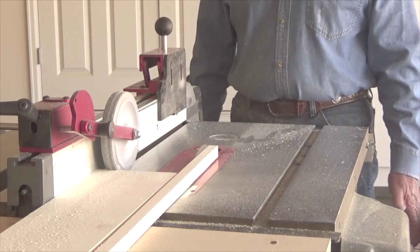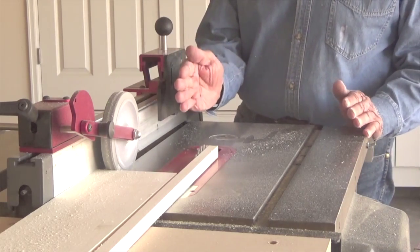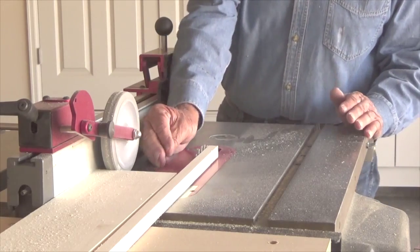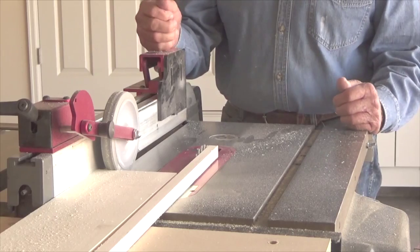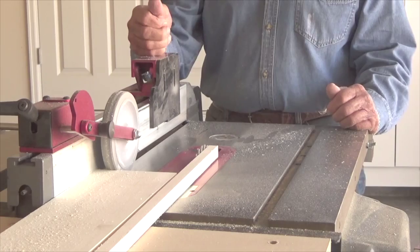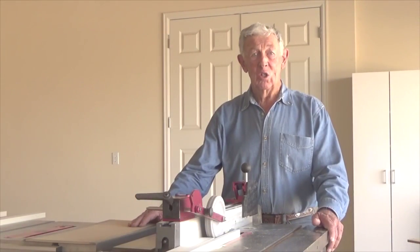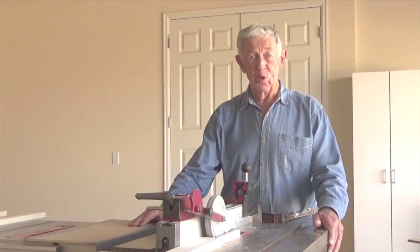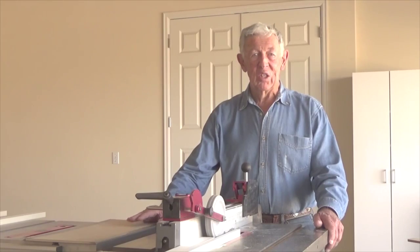You can see there's just any kind of cut you want to make. You could have pushed that through with your hand, but look where it would have been. This way your left hand was clear back and your right hand was up here out of the way — so safe and such an accurate cut. Using this system, you can pick up at least 30 minutes per day of productivity, and it keeps your men safe.